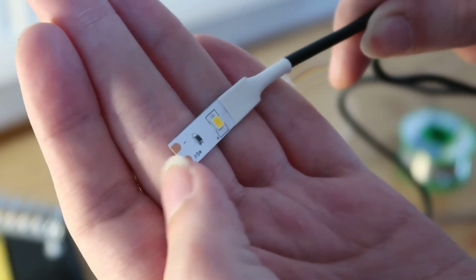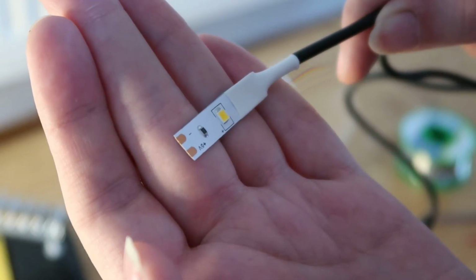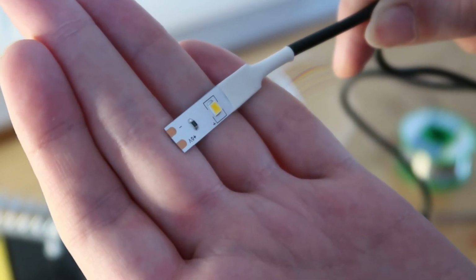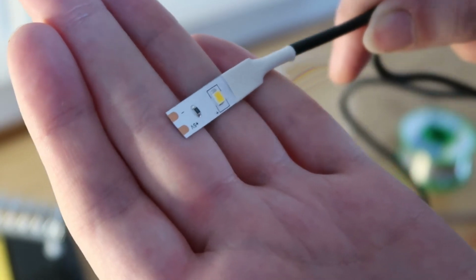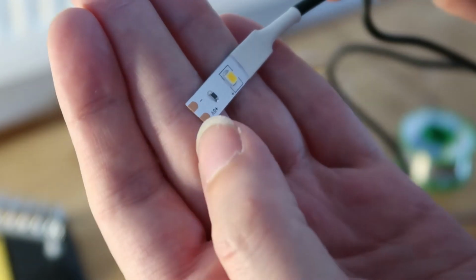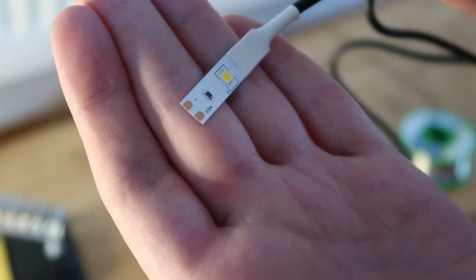It's very important that we do not let the positive and the negative touch each other at any point, because that will create a short that will just mess up the circuit and could potentially make a fire hazard at some point. So the first operation is going to be to solder the specific wires to these plates. And to do that,